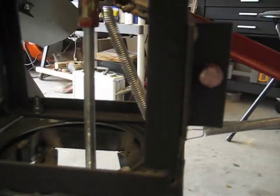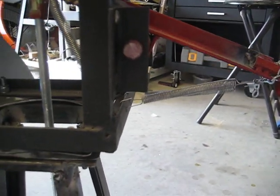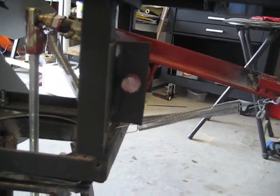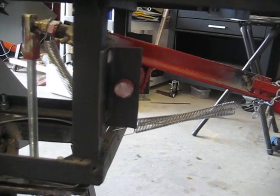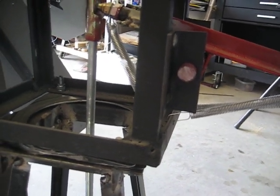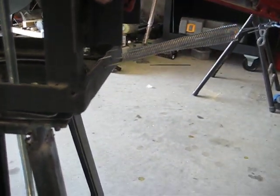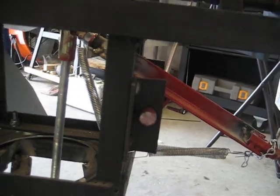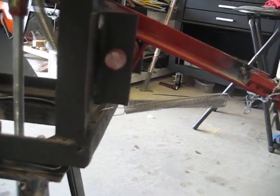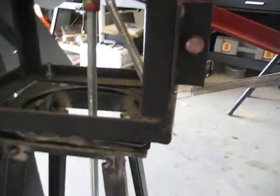I have the springs on there, though I'm not sure they're going to be necessary. In the original configuration of the pump I needed about 12 pounds of lift and 4 pounds of downward pressure. In my bench test I was getting about 6 pounds either way statically. So I added the springs to give it a little extra oomph so it will kind of center on its own. Once the system is up and running, I may be taking the springs off — we'll see.